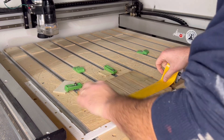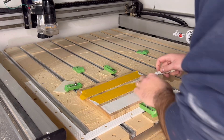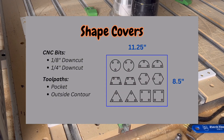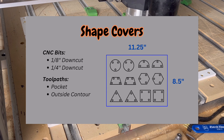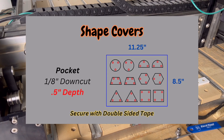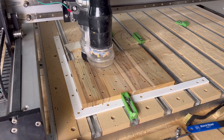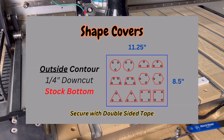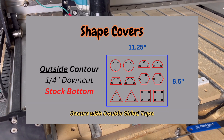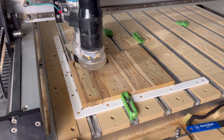For the shape covers, the most important thing to note is that I'm using double-sided tape to secure them to the CNC instead of clamps. The first tool path is a pocket with a quarter-inch down-cut bit at 0.5 inch depth for all the holes that will fit dowels later on. Then we finish with the quarter-inch down-cut bit carving all the way to stock bottom with an outside contour — no tabs needed because of the double-sided tape.